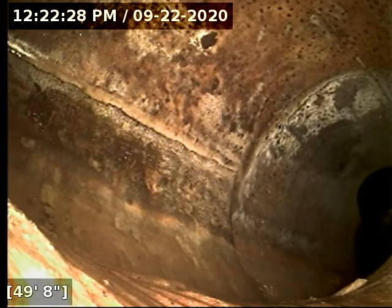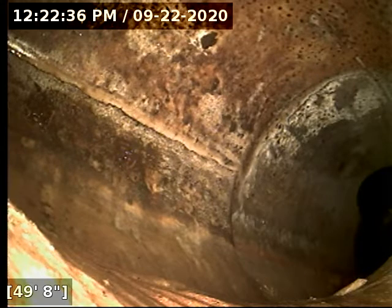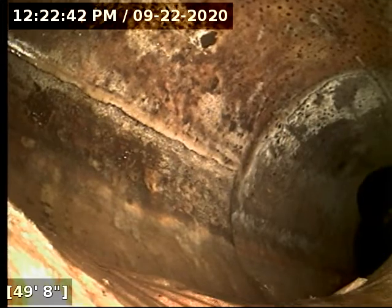Alrighty, I was able to get a half-decent locate signal here. The line appears to be going to the rear alleyway, and the back gate is padlocked, so I can't walk through it into the alleyway, but as soon as I get up next to the fence line, I start picking up a very strong signal on my locator. So we'll pull back here to the transition and relocate just to double-check that.